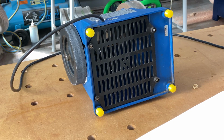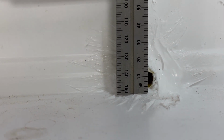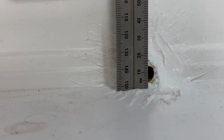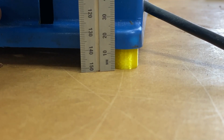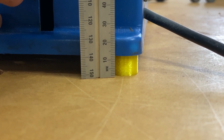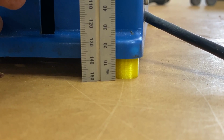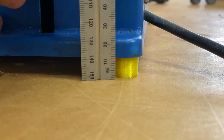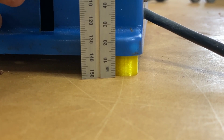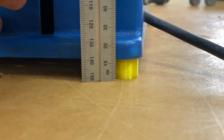than the old feet. Okay, first to admit that's not my best siliconing. In fact, it's pretty messy, but it'll still work, and that's all that really matters. And if we have a look, the top of that drain hole is appearing at 15 millimeters. And if we come over here and have a look at the Tormek with its new feet on, you can see that 15 millimeters is only just above the bottom layer, so well below the electrics now. And I doubt that the water in the bottom will ever get over 5 millimeters. I doubt it'll even get that high.